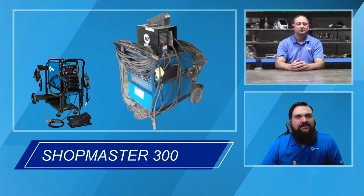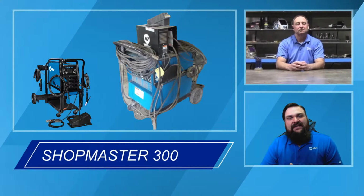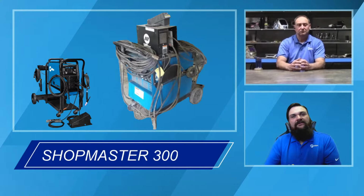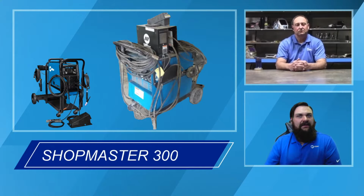So as a comparison, this machine is going to be similar in output. It's going to be just a little bit lighter duty than what the Shopmaster was in some aspects, and very similar in others. But if you look at the physical size difference in these, you're talking a lot of floor space difference here as well, and power. We'll talk about that a little bit coming up as well. Those older style transformer machines loved power, especially when you get on the AC TIG welding side of things. But again, coming back to what Chris had mentioned on the transformers, to get a different output, we physically had to grab a different portion of the internals of that machine to get a different output.